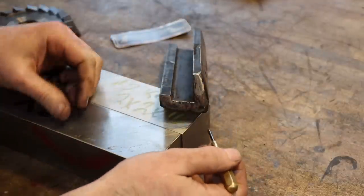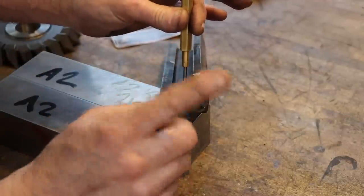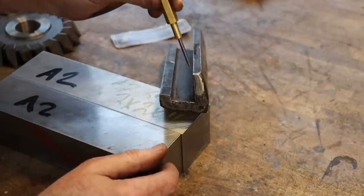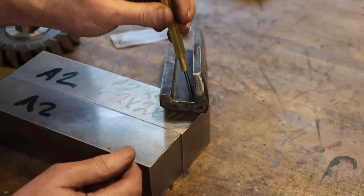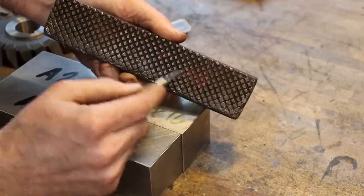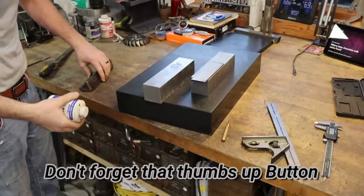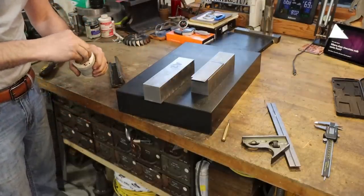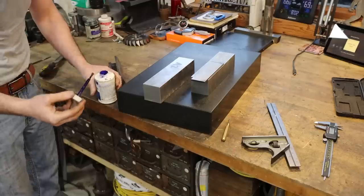But because I've only got two vise jaws to make, I think I'm going to be doing this on the vertical mill just to blast out the bulk of material. And then we'll go to the shaper and we will refine this shape with a compound of that machine. I think we can pull it off that way. So we're not going to be reproducing the waffle face on this, even though we could. Logan's going to do that on his CNC machine. So without the original tooling and fixturing to make these old parts, sometimes you just got to get creative and do it the best way that you have with the tooling that you have.